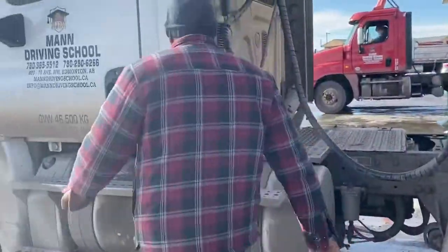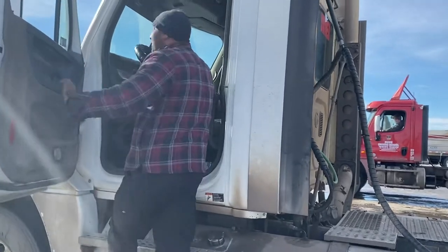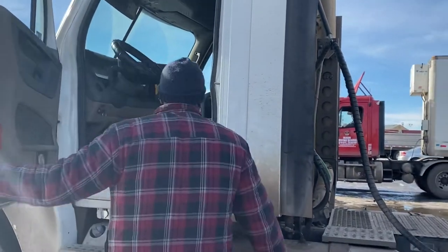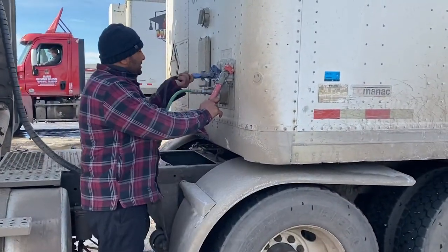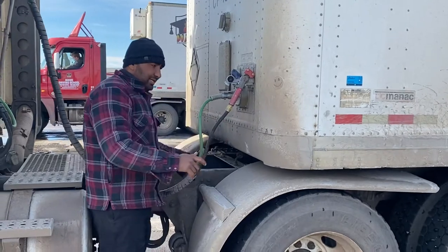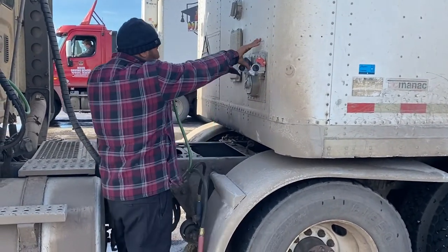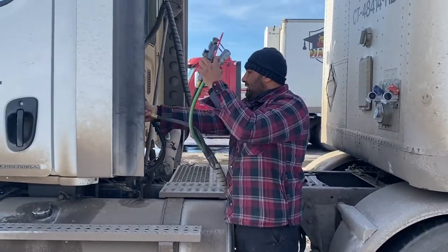My landing gear now, but before moving the line, I make sure my vehicle is properly secure. My yellow button and red button are out, they're already out. Now I disconnect my air line. So, blue line first, leave it here, red line here, then pick up here, then put the electric line. So now I can properly secure my lines.